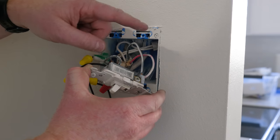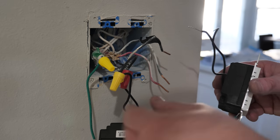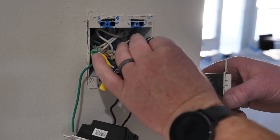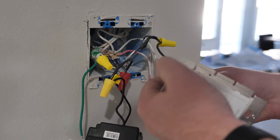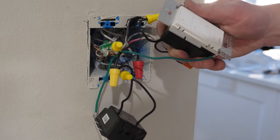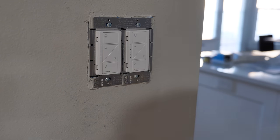Just like before, here we have three different wires. One is a different color so we tape that off first. Once the old switch is removed, tie into the ground, tie one black wire into the un-taped wire, and cap another black wire with the taped wire. Note your wiring colors may be different. Because this is going next to another switch, pop off the tabs, and now we can get them installed. It does get a bit crowded with two smart switches, so carefully push them in until you can screw them tight.